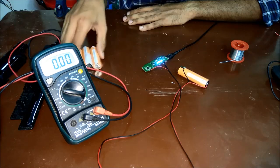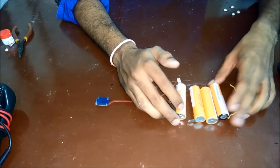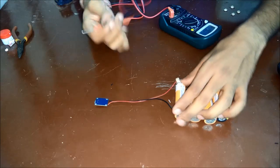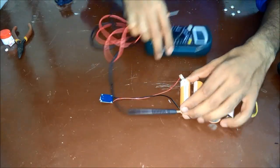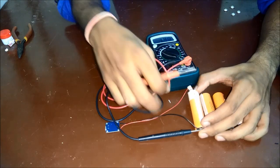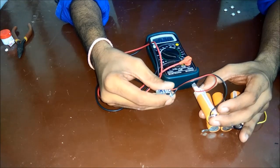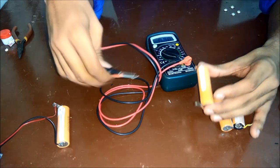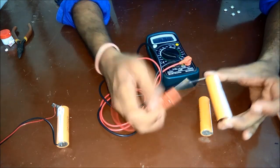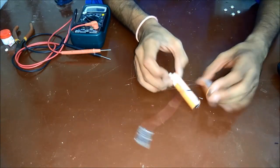It's been almost two to three days and all the batteries are charged. I'm going to make a rechargeable torch out of these, which can be used for multiple purposes. Measuring the voltage: this one is close to 4.12 volts — that's a good voltage, charged with the small lithium-ion charger module. Another one is 4.07 volts, close to 4.1 volts. I'll be using these two batteries today in parallel, and the third one will be used for some other project.